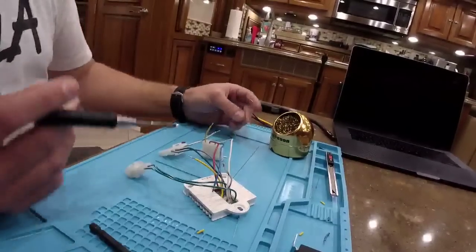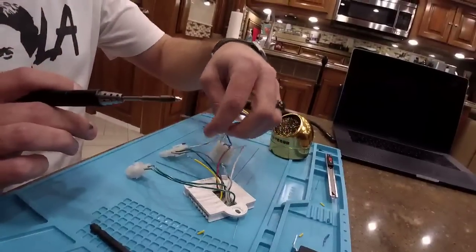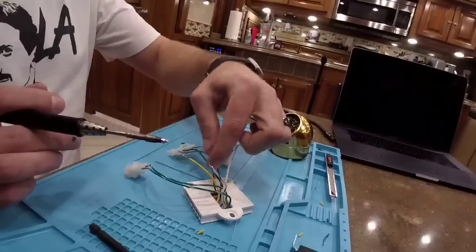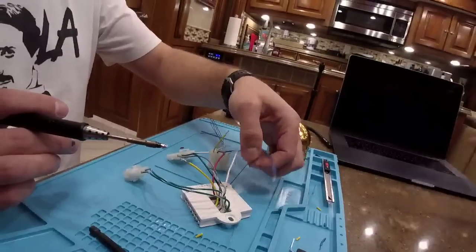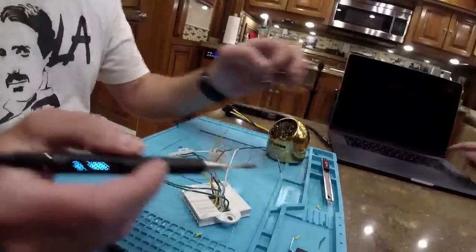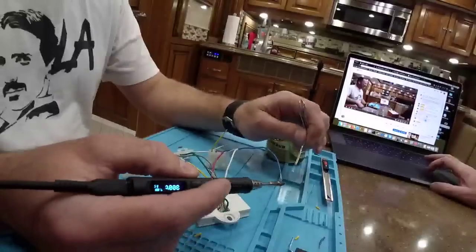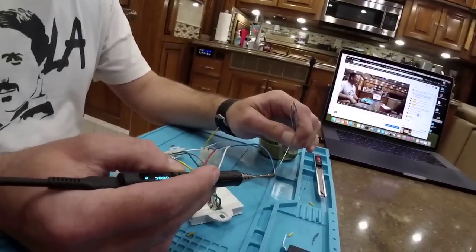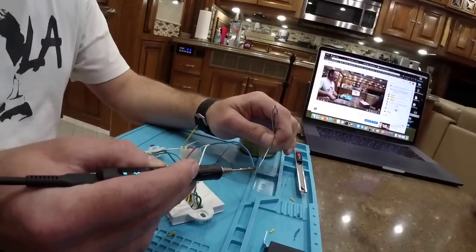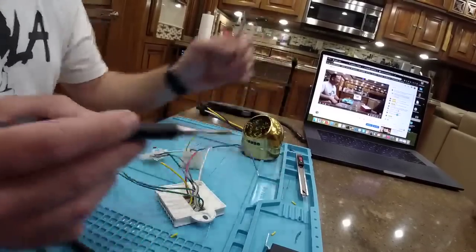Yeah, okay, so the question was, how would this be different if using it on a Tiffin product with Spyder controls, controlling the thermostat, controlling the heating and cooling? And the answer is you really can't do this on those because the wiring for a thermostat doesn't actually exist. It's actually controlled over a data network. But you can go to coachproxy.com and find instructions on how to build a Coach Proxy yourself if you're handy.